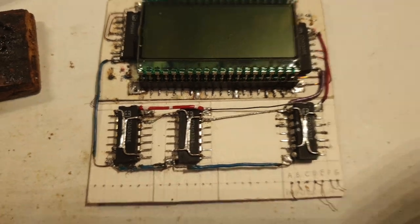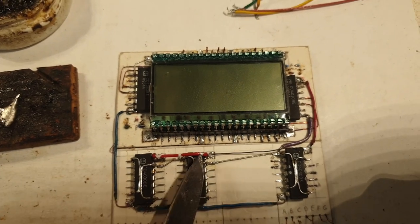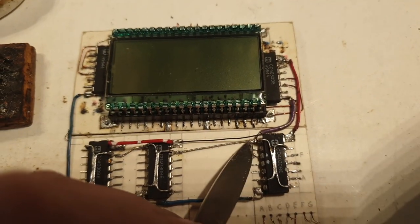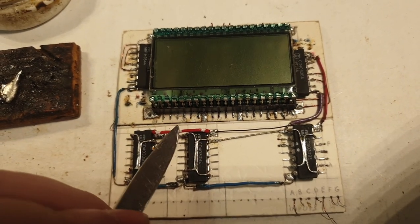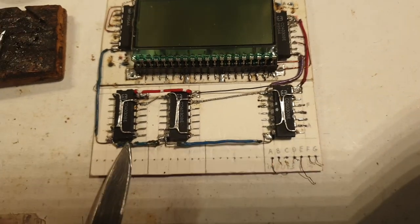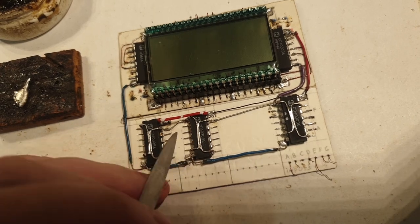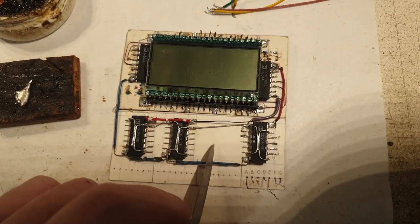After testing, I did a little more work. I mounted two chips and made the common signal on all four inputs for both of them. Then I connected the common signal to its branch, connected the positive power rails for both chips, and ran the negative wire from the relevant chip. Pretty much I connected the common signal wire for all the inputs and gates, and the power rails for these chips. Next is to add outputs from these chips to their respective pins.